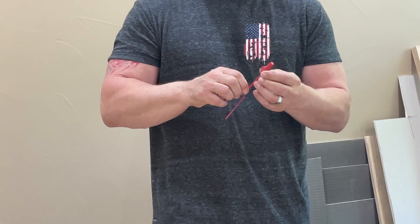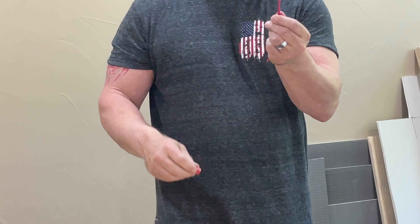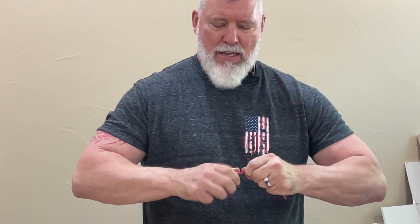If you don't twist it right, the wires are going to try to pull out. If I pull this apart you'll see it didn't really make much of a connection. You have to use the little wings and twist it until it's extremely tight — like that — and it twists the wire going down. When I pull it off, it's made a good connection.